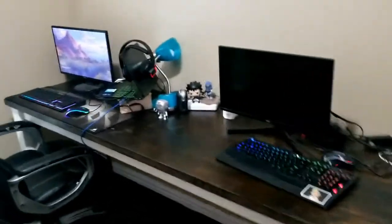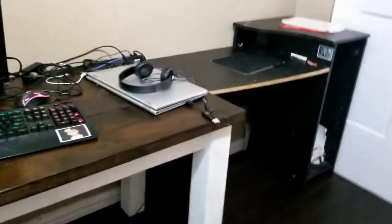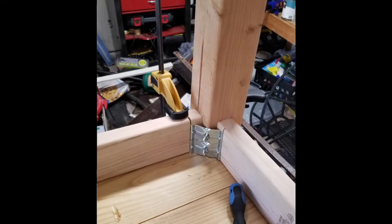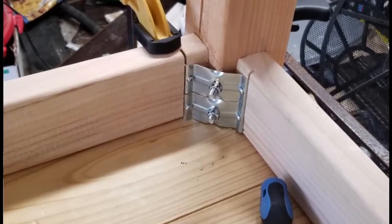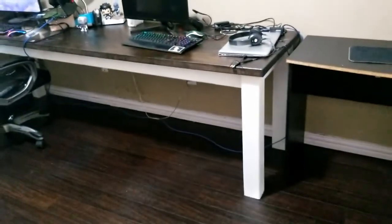It is 2x8 times 3, and it came together pretty well. Put on a table base that I call a shaker stout — I don't really know what it's called, I'll be honest. But a 4x4 post, 2x connecting in, pocket holes basically joining everything together to the tabletop. And I doubled up on the table leg brackets.